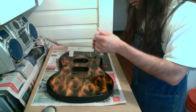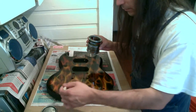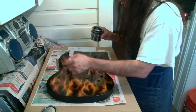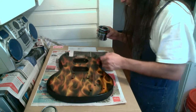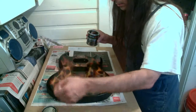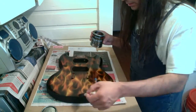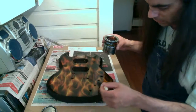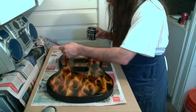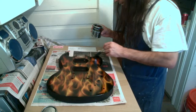Pretty low-tech operation, or startup anyway, but it's going to get the job done and this is going to look really nice when I get it all done. I just wanted to show you the process of what I'm doing and how I'm doing it. Then once it dries, I'll wet sand it and it'll take out the brush strokes. I did this on my other guitar and it worked out really nice — put on a nice hard glass finish. So what you do is put a coat on, let it dry, sand it, then put on another coat, let it dry, sand it, put on another coat, and you keep doing that. It gives a lot of depth to the thing you're coating — in this case, this guitar.